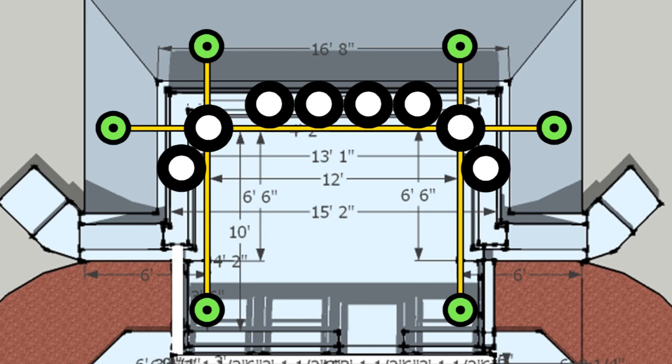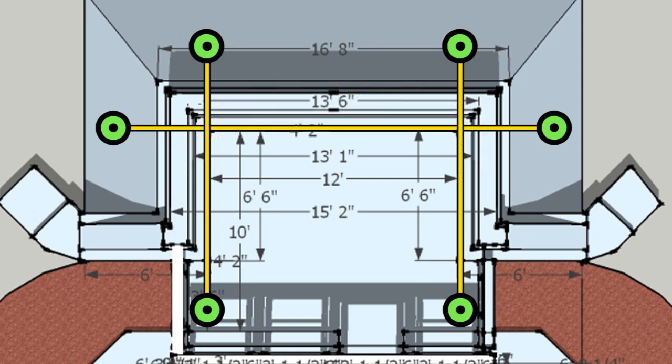See that little gap in the northwest turn of our wall? That is common in tire wall construction. If the gap is large enough, we can fill it with a small tire that gets squeezed in between. If the gap is too small for a squeezer, we fill the gap with concrete. All that will be explained in our upcoming tire work video.